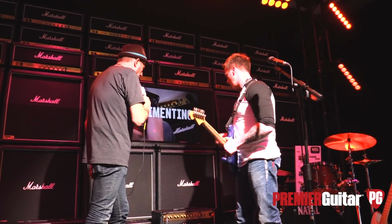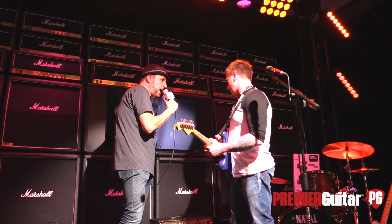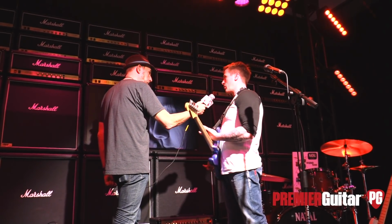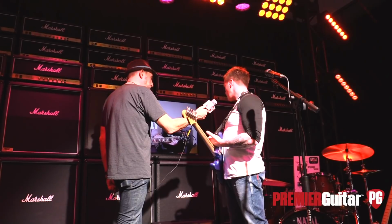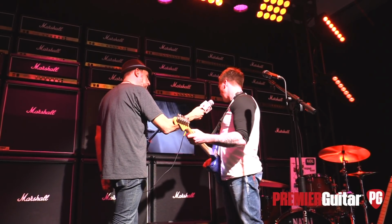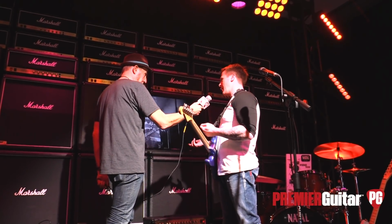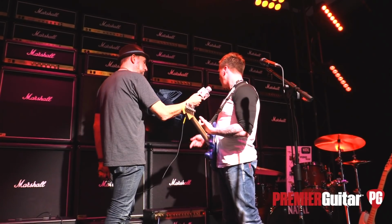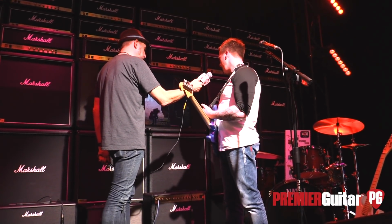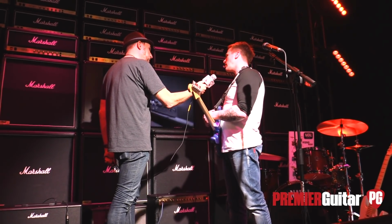Cool. Well, for folks who aren't familiar with this line, including me, can you tell us about the tube array and some of the other componentry inside? Yeah, sure. So tube-wise, we've got four ECC83s in these, the preamp valves. And then there's two EL34s in this particular model. And basically, channel-wise, it's real simple. It's clean, dirty. Yeah, exactly. But on the 40 and the 100, there's two modes for each channel as well. So you get clean on channel 1 or crunch, and then OD1, OD2.